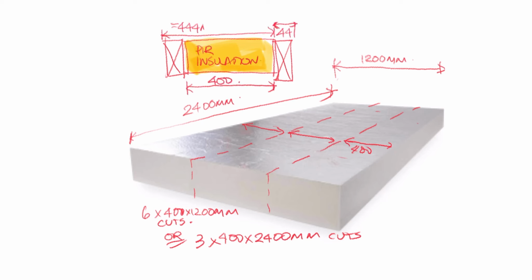For this particular floor frame, I'm using 95mm joists due to the short spans, so I'm having to snip the top of the projecting bracket to enable me to fold the metal down. I'm just using a pair of tin snips for that. You won't have this problem if you're using 120mm joists and above.